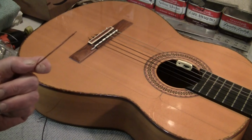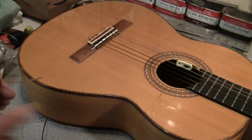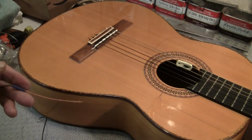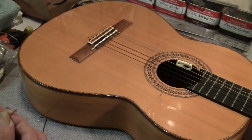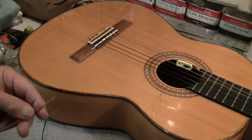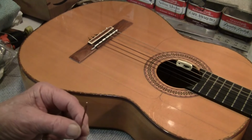This is a piece of coaxial cable. This is the shield. There's a conductor inside. Then it's insulated, just a piece of wire. The conductor's the wire, the insulator's Kynar. So this whole thing is a pickup. And it could be made in a spool of 100 to 1,000 feet, chopped up, and it has to be terminated. This is the return circuit, the ground circuit, the shield. It's soldered to the conductor that's inside, and that's what brings the signal to the amplifier. The trouble with these is they don't put out a lot of power. Not a lot of voltage.